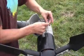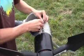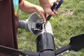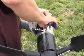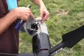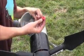We've already put some petroleum jelly on our leads here to help prevent corrosion. It's always nice to twist your wires first before attaching your wire nuts. So we have white one and white three going to our first brush wire, and we're going to attach our red wire nut.